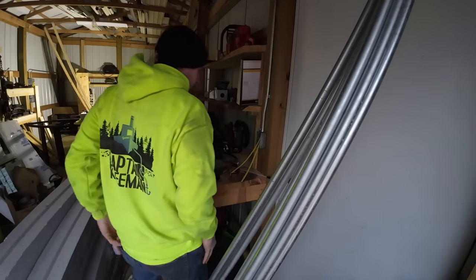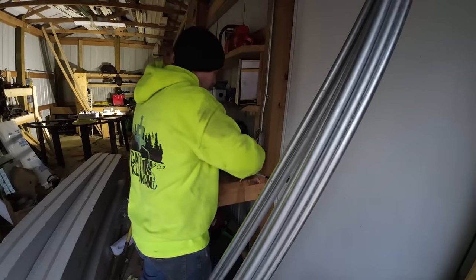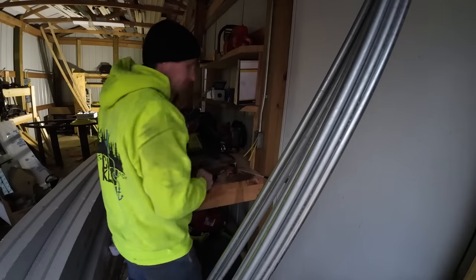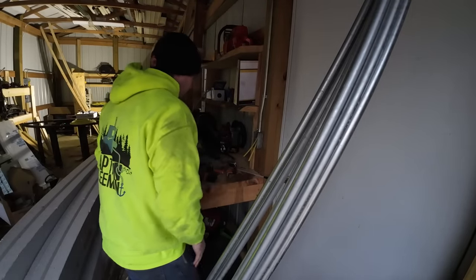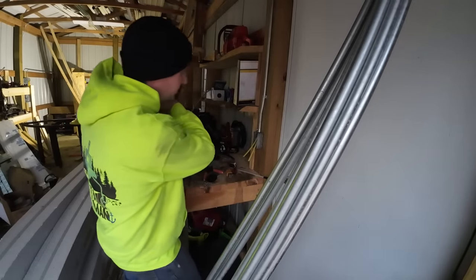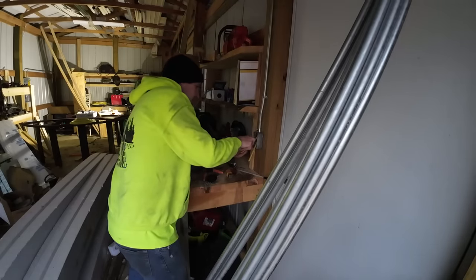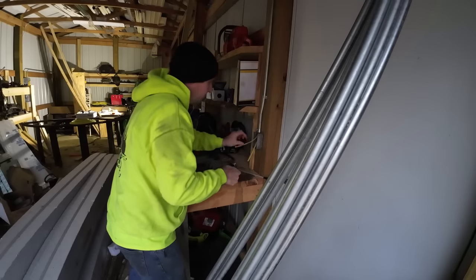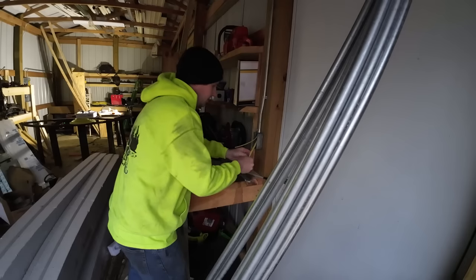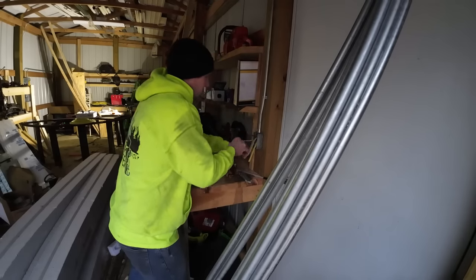So one thing that's definitely going to be a little awkward with this setup is that thing auto shuts off after 4 hours. If it's not getting charged or it's not outputting, it turns itself off after 4 hours. Energy conservation makes sense. The issue, of course, is going to be if I'm gone for more than 4 hours, which is pretty likely, and I come back to flip this switch, well, nothing's going to happen. So we're going to have to walk all the way over to that side, turn the unit on, and then come back and hit the switch. If this were the permanent long-term solution, I'd put the switch closer to the box. But since we're setting this all up for eventual on-grid power, we'll go ahead and run it over here.